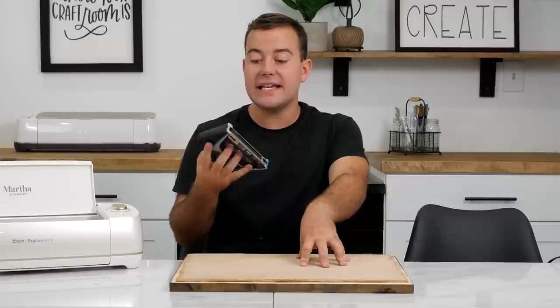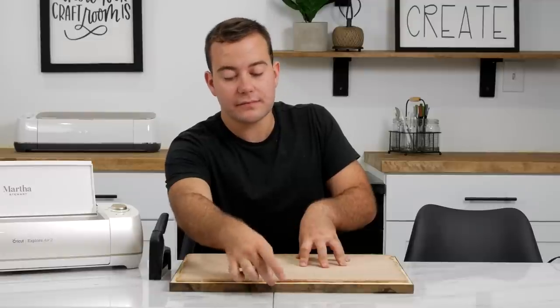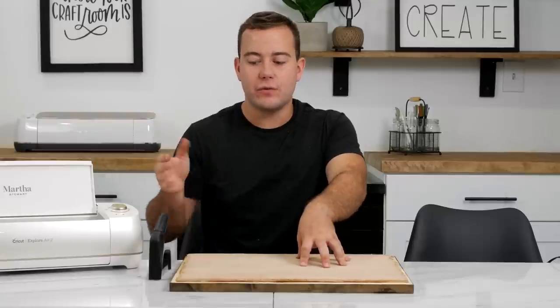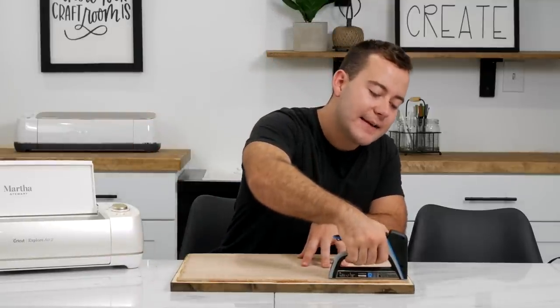You just want to have one of these and make sure that the staples are thick enough to go through your half-inch plywood into the main frame — I'd do about three-fourths of an inch to an inch. Once you're good, go ahead and staple.